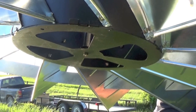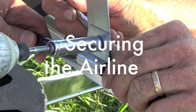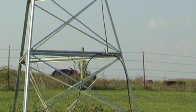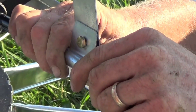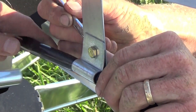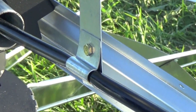Next, lock the hub onto the compressor shaft with a 5/16 inch bolt and attach the dome to the hub. Securing the air line: secure the hose to one side of the tower. This can be attached to any point on the frame using zip ties. Bolt the hose bracket to the tower. Place the hose between the elongated hose bracket and the clamp, then bolt them together. Be sure to secure the hose to the bracket tightly, as this will force the hose to turn on the 90 degree hose barb as the windmill head turns.